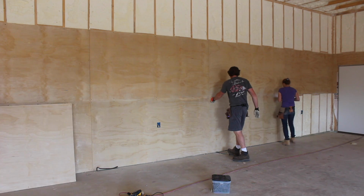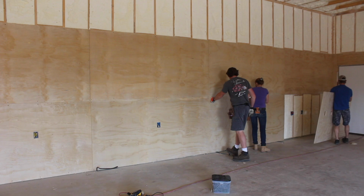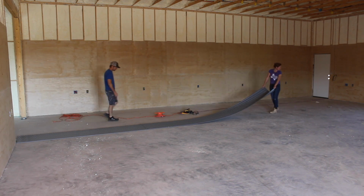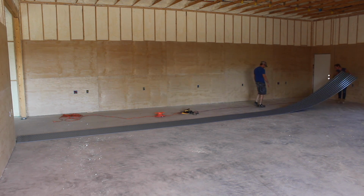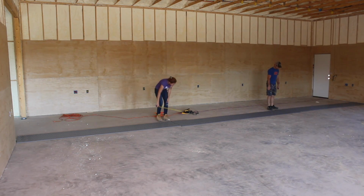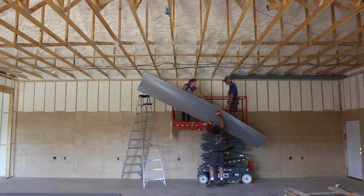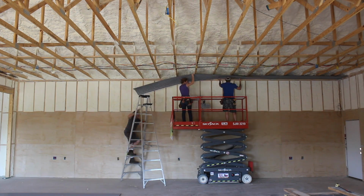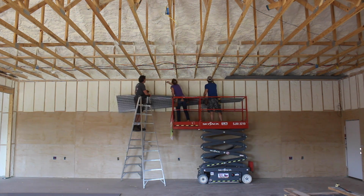Of course, I first reattached these 6 panels on the wall that I had taken down to let dry out. But then I laid out 3 full panels of the ceiling material on the ground. This allowed me to play with the spacing of the head laps and work out the look it will have on the ceiling once installed. I didn't worry about landing on the seams and trusses here. Instead, I just made the laps equal. I once again started at the back, but this time I started at the far right, so that whenever I enter into the main entrance, again it will look seamless.